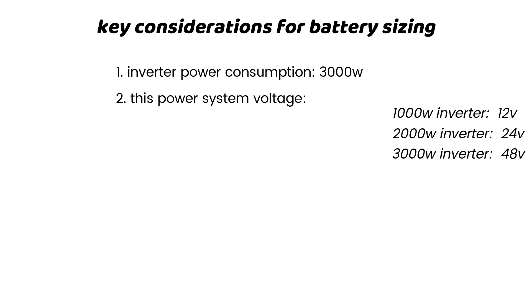So the battery and inverter voltage is 48 volts. This setup can be done in 24 volts or 12 volts, but decreasing voltage will increase current, leading to the high cost of getting cables, charge controllers, and fuses to handle the high current that comes with a 12-volt or 24-volt system for a 3000-watt inverter power setup.